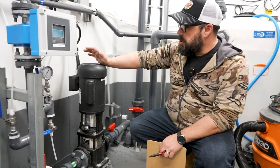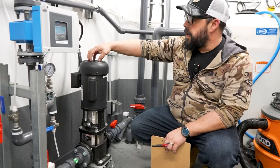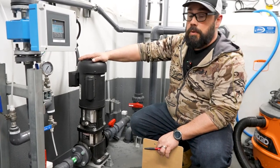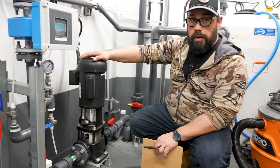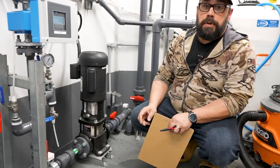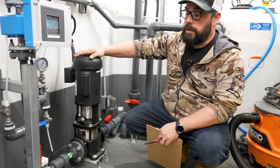In normal conditions, you'd want to soft-start your water system when purging out the air, which means having a VFD pump — a variable frequency drive pump — so you can tell the pump to only start at 25%. This pump is not meant to be throttled; it is on or off with no speed control. If we had a throttling valve before or after, we could do that to 25%, but then you're causing unnecessary back pressure on your pump seals.